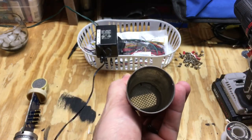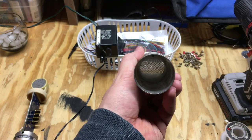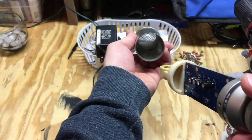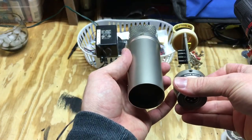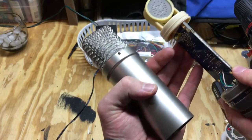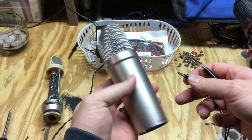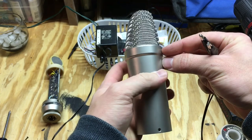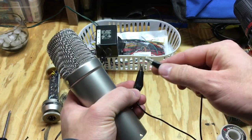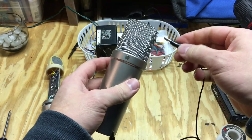As you can see from the inside, you can see that little tiny screw popping through. Fortunately, when we put the mic back together, the screw will just miss our capsule. Here is the moment of truth — we've got our screw on the back side, which is now hopefully connecting the body and the screen together. As you can see, we have continuity — clip it on here.